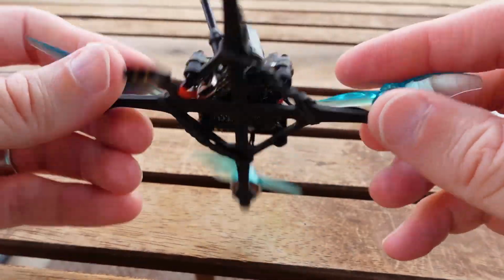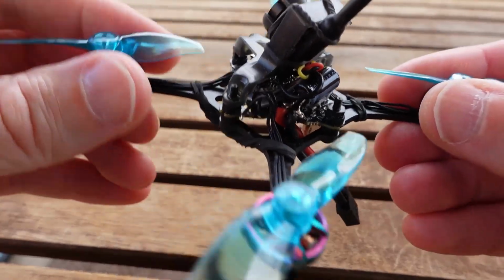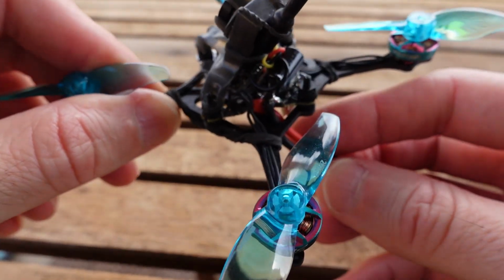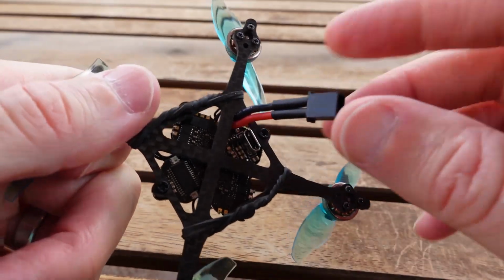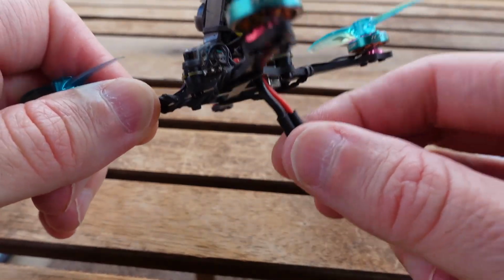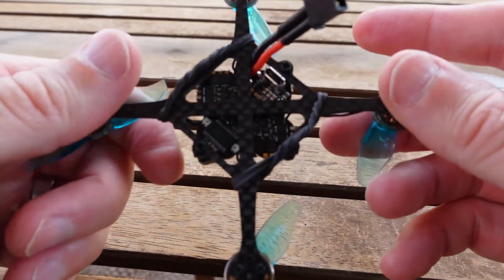The other thing is, too, you see the motor wires, or the battery wires, you see how I put them on? See how I solder them on top? That's because you don't have a big enough through hole to fit an 18 gauge through. And I'm not going to just solder the 18 gauge down to the bottom and have that pull or lift pads off. I'm going to put it up top and route it down so that it's anchored a little better, less likely to just pull straight through.